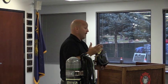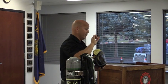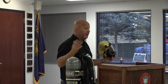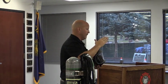The difference for you right now is your current SCBA starts the red at 25%. So the new standard has increased. They call it the EOSTI, end of service time indicator, your alarm, your warning, however you want to title it. But basically that is now going to start sounding, light, visual, touch, whatever way it does it, at 33% rather than 25%. The mentality is to tell you to get out of the structure, but to give you more time if you hit that mark to be able to exit the structure.